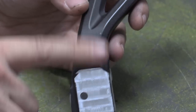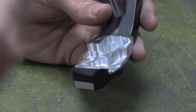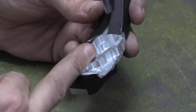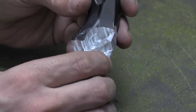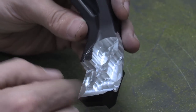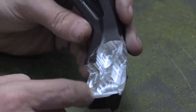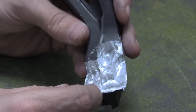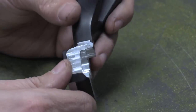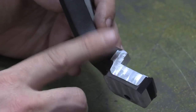But once we've got this fillet in here, or whatever I decide to do with it, once all this is filled in, at the same time, I'm going to put a slot in this and then add some more aluminium at the bottom, sticking out, that'll just slot in there. So Frank can, like I said, this is just to quickly get rid of all the rest of it so we can see what we're doing. You can then tack it in, weld it in. I'll do all the weld prep. I'll just give him the parts and say, this is a template, make it fit this with this and this. And what I want Frank to do is just overfill everything, absolutely fill everything.